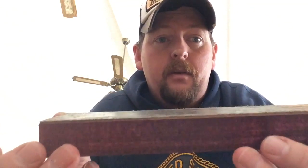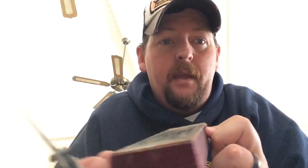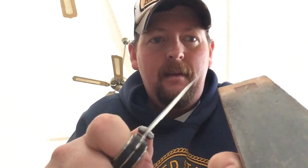One of the problems you have with strops — and I like this strop, it's a pretty nice strop — the leather's not real thick, so you don't run into the problem as much with this one. But what happens is, if you put it down and push, the leather's soft. You have your edge and you push it in, and as you're dragging it, you're rounding that edge over on both sides and you wind up losing your edge. You roll your edge, or you blunt it, because it makes it really convex at the edge.